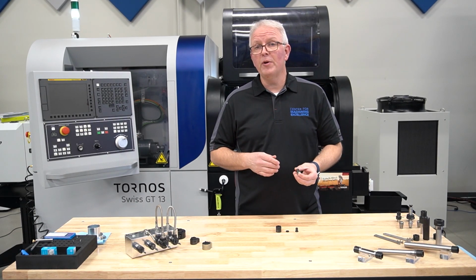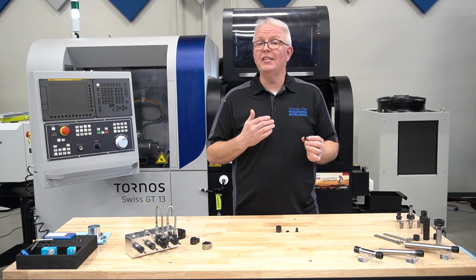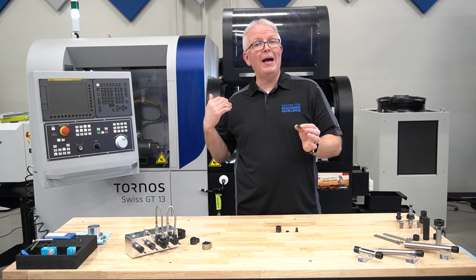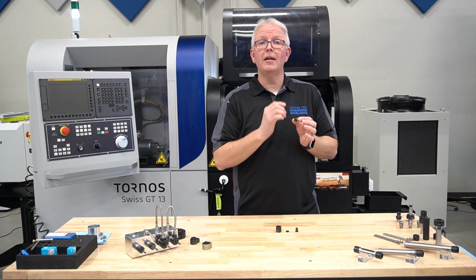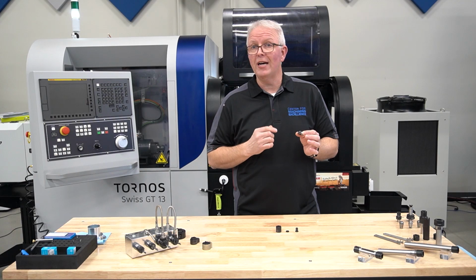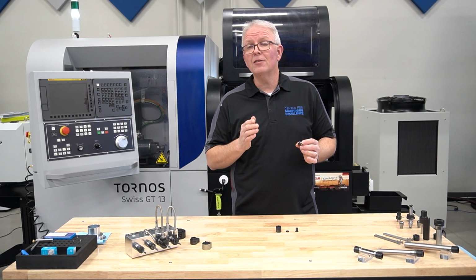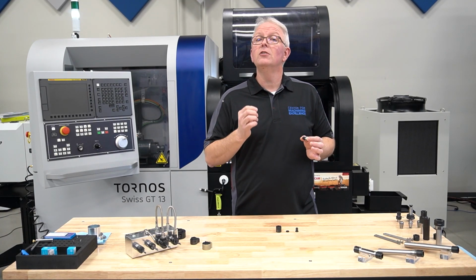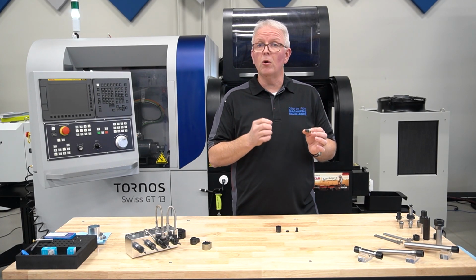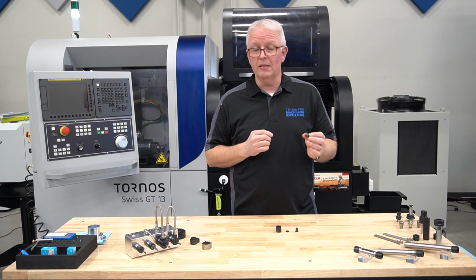Easiest option to start with is the metallic sealed collet. These collets are made to seal off coolant coming from the back of the tool holder to make sure it seals before the gauge line, making sure that coolant goes out to your cutting tool. Now with these, remember, metallic sealed collets don't have the full range of a regular collet. So you do have to make sure we are closer on diameter than you do a regular ER style collet.